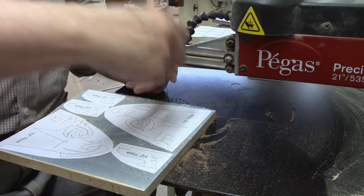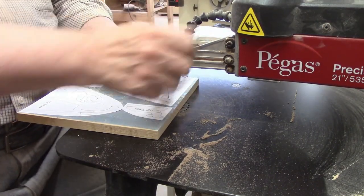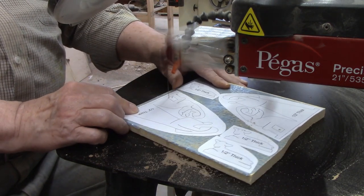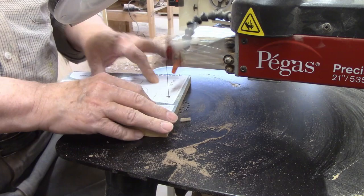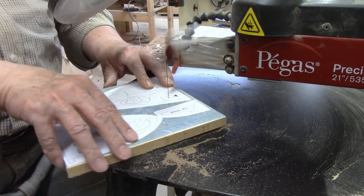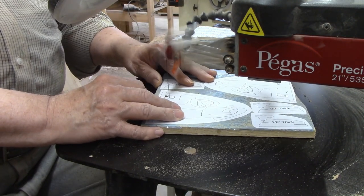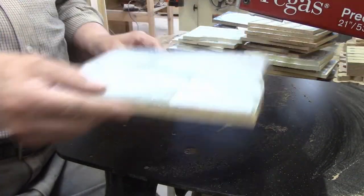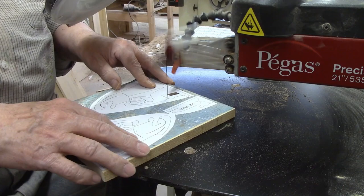I took the long board containing six sets of figures and used my band saw to cut it into three parts, making them a workable size for the scroll saw. As usual, I made the interior cutout first. I left the number five blade in the saw, thinking it would still be large enough to handle the half inch ash, even though ash is a very hard wood — it's used to make baseball bats. I cut from the pilot hole to one of the corners on the bottom of the shape, backed the blade up to the pilot hole, then cut to the other bottom corner. I backed the blade up to one corner, pivoted the workpiece, and made the cut along the bottom. With the waste piece out of the way, it was easy to swivel the workpiece for the next cut up along the inside of the square, backing up slightly at each intersection and turning 90 degrees.